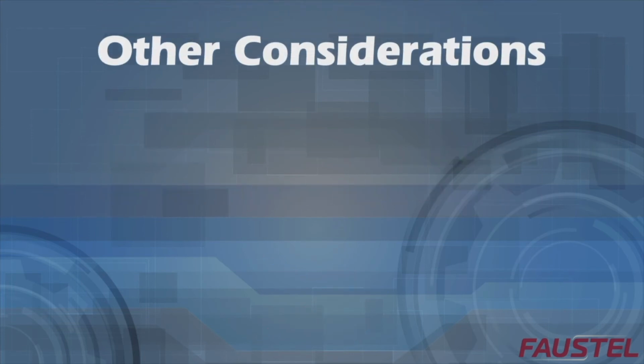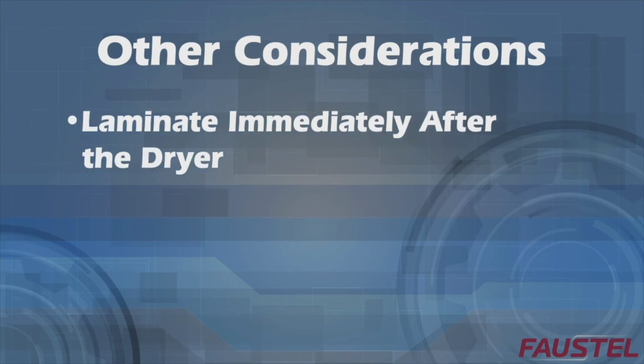In closing, there are a few general design considerations for a dry bond laminator. It's always a good idea to laminate immediately after the dryer in order to minimize exposure of the coated web and to maintain heat in the web for those processes that benefit from elevated temperatures.